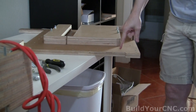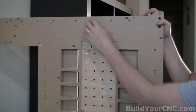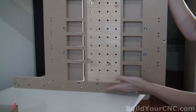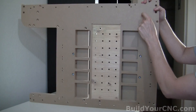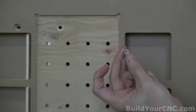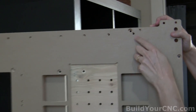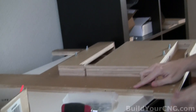Now we need to put in number 8 inserts for the rails. On this side, the rail is going to be rigid — it's not going to need any adjustment. On this side, we're going to have the ability to adjust. Even though the V-groove bearings will adjust in, we can adjust it for straightness or parallelism across both sides. But this one is going to stay rigid. So we're going to be putting in these number 8 nut inserts, and it's going to go on the other side. We're going to use these holes, not the counterbore holes. We know we have to put it on these two, so let's start with that.